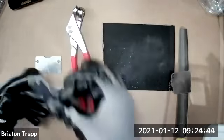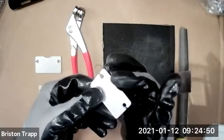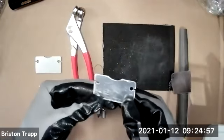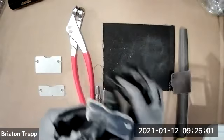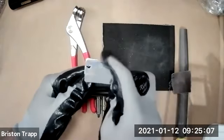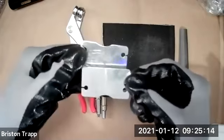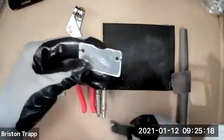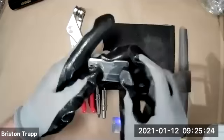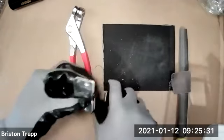So these three parts have a stack up and layout that is somewhat critical. There's a notch on each part. That notch is purely just for laying it out correctly. It's kind of a mistake proofing concept used in manufacturing, the Japanese term would be poka-yoke. So basically, all these notches need to line up. So this would be incorrect because the notches are not facing each other. So you're gonna take a big part, sandwich a smaller part in the middle, and put a big part on top. And then you'll take a Cleco.